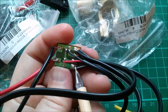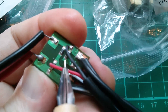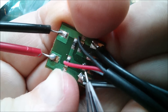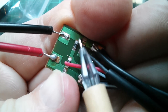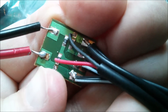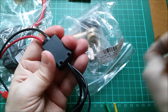Why would you put resistors in line? Are they potential dividers? It looks like one of them is and one isn't. The resistors look like 203 — so that's 20k, which is a lot of resistance. One resistor goes to positive and one to negative, making a sort of midpoint potential divider, but the other one just goes to negative through a 20k. I don't get that bizarre arrangement at all.